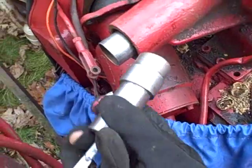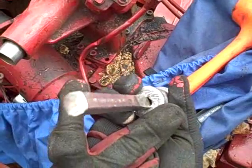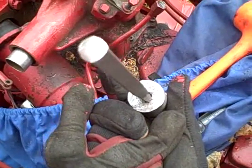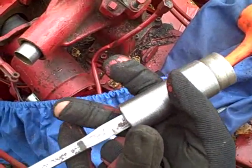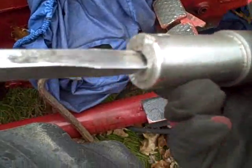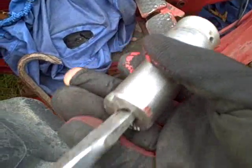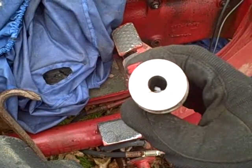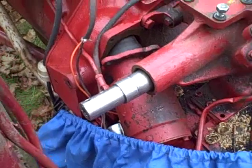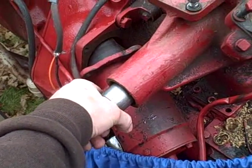This one I need a little more clearance, so I really only want to use my arbor without this chisel that got jammed in the end there. It worked its way into the metal as I was pounding it - it's in there pretty tight. I can wiggle it just a little bit but it does not want to come out. Luckily that's not a blind hole, so I'll just stick a drift in from this side and tap it out. Got the chisel removed.